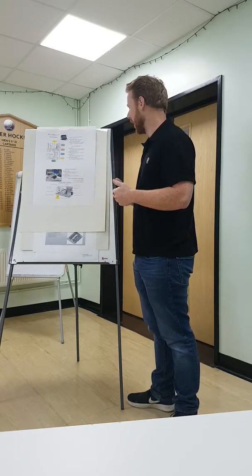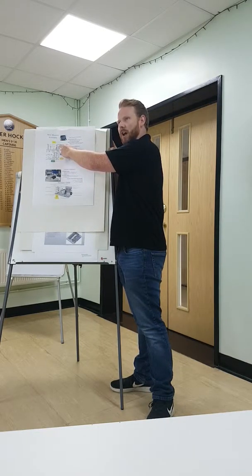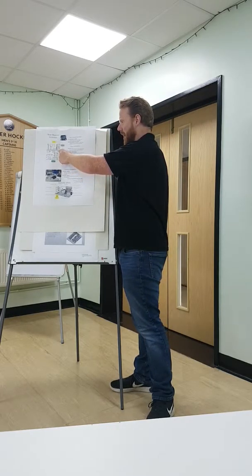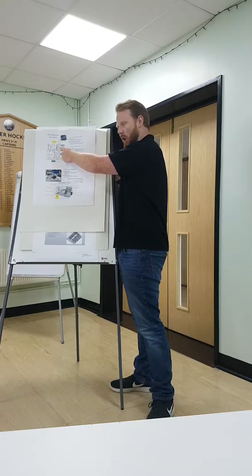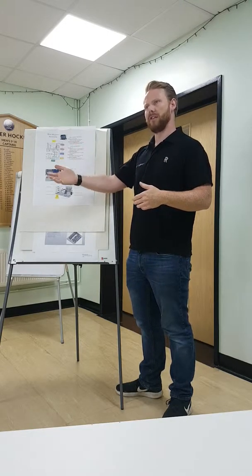The locations are designed with ergonomic considerations for the physical logistics team rather than the assembly team. On the bottom shelf you may have the left-hand and right-hand brackets; on the top shelf, because they're light, you'll have the back brackets and the monitors for the RR11 and RR12 stored in one location, and the RR31 in a different location. The associate is expected to know where these are and travel from the assembly location to the picking location to get the parts. There is a degree of man-machine interaction because he takes a digital scanning device to confirm that the parts he's picking are suitable to that vehicle — otherwise you end up with the wrong touchscreen monitor fitted.